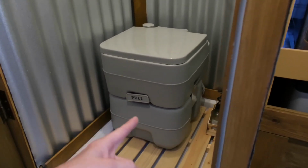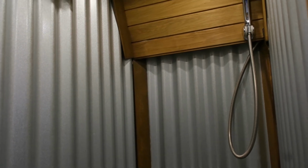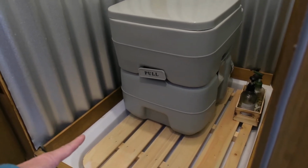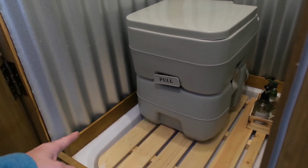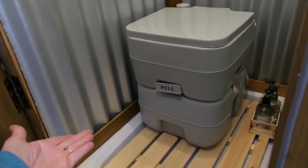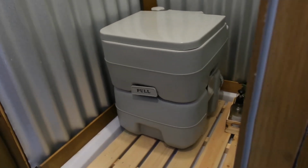And then whenever we take a shower, this just comes out, completely take it out. Walls are just corrugated aluminum, super simple, and they're waterproof all the way down. And I put some aluminum tape on all the seams and silicone. I get a lot of questions about it. It looks like they're outside of the shower pan, but they're not. Behind the corrugated aluminum, the shower pan actually is flat and then it comes up and makes a lip. So these are actually inside of the lip,